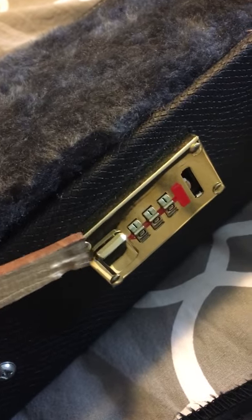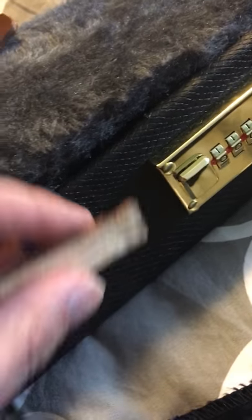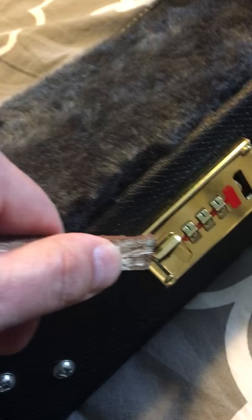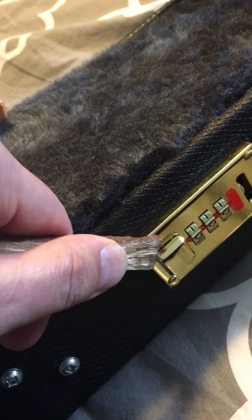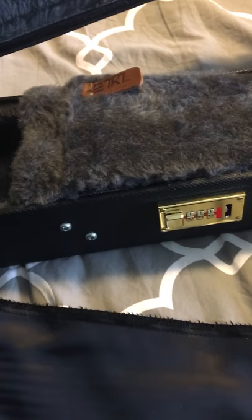I use the piece of wood to put over here when I'm pounding them in — I don't want to pound these with a hammer and actually damage the new lock. I just put it right over it and tap them in, because there should be old holes that are pretty much all set when you pull the old ones out.